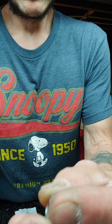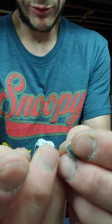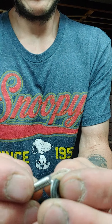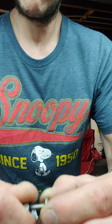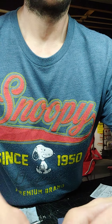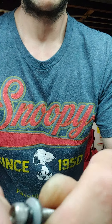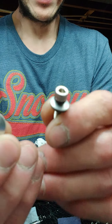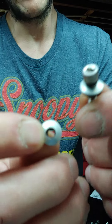All right, so this is your 316 bonded sealing washer. These have actually been washed about six times and don't show any worse for wear. You'll put this on, then thread it in — you don't want to push it because you want the rubber to be properly sealing. What the first o-ring does is provide an extra layer of protection so nothing gets through that little spot on the bonded sealing washer, right here.